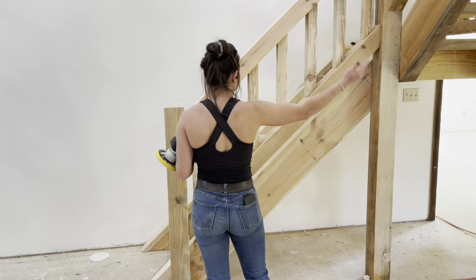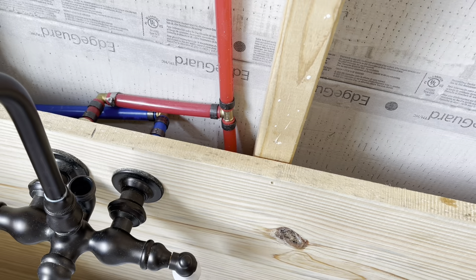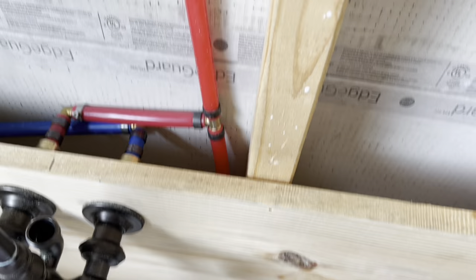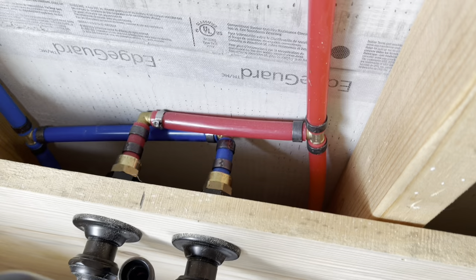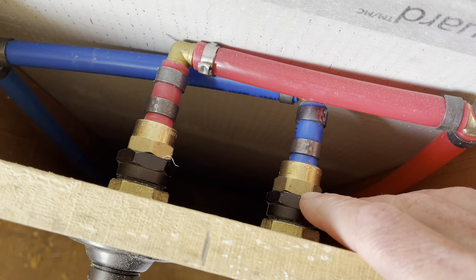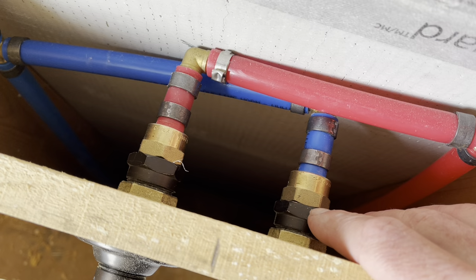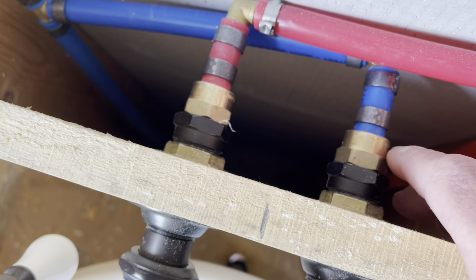I got it to a point yesterday and I probably could have finished it, but I was concerned about this fixture. I didn't want to go ahead and cover this wall and put the trim up and then come back and have a slow leak or something like that. Because these fittings right here have a gasket in them — like a rubber gasket. You can tighten these things too much and crush it, or not tighten it enough and not get a good seal. I like Teflon fittings — I don't like gaskets. This is like a garden hose fitting that threads on to here, so I'm just not real fond of that.